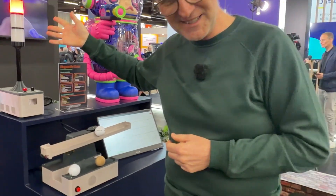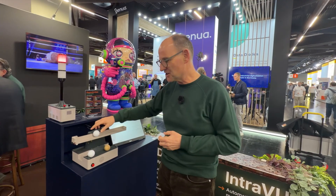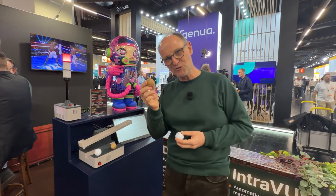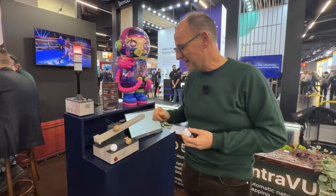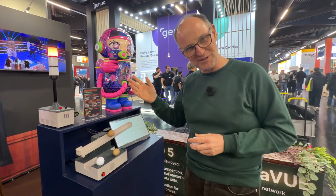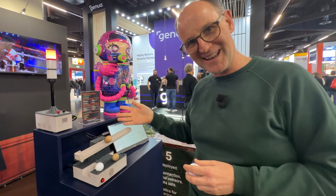The red light means that the control loop has to struggle more than usual to maintain the balance because the ball has a fault. If I replace it back with the smoothly rolling wooden ball, the machine goes back to normal operation and we will soon see the green light again.